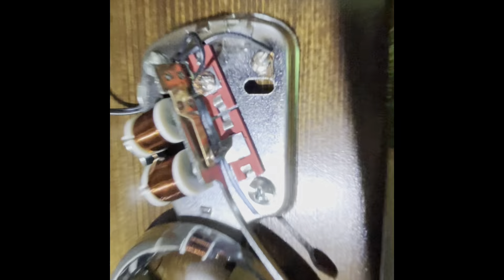The hammer — I had to adjust it because it was too close to the bell, so it was mainly slapping and I couldn't really hear it ring, just 'ding ding.' But if it's too far it obviously won't hit it, so I had to bend it to the perfect sweet spot. Let me take the top cover off — there are these coils. I think this runs on an electromagnet-type design. One of the screws goes straight into the metal base but it's 9-volt AC so it can't hurt me.